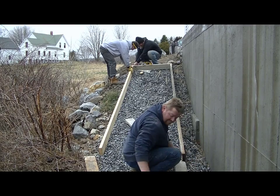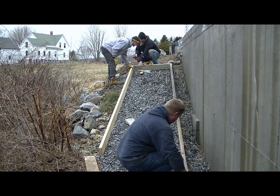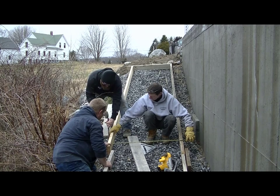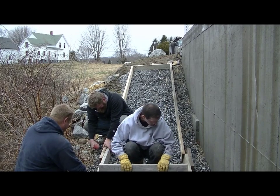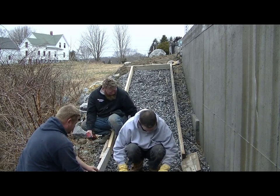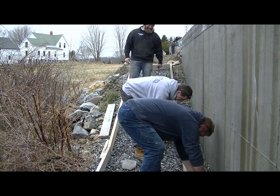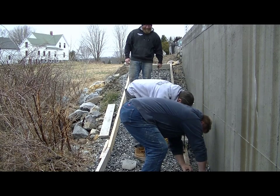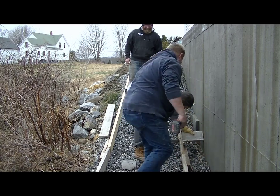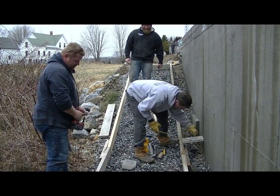It's just a walking path so they can get from that upper level down to this lower level without having to walk or wheelbarrow in that crushed rock. They told us they wanted a ramp about three feet wide, gave us the starting point up top and an ending point — it ended up being about 16 and a half feet long, about a foot away from that retaining wall. That gives us about a five to six inch thick ramp.